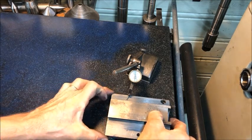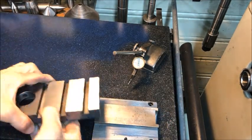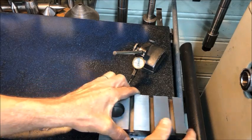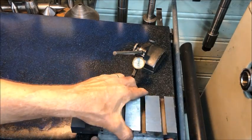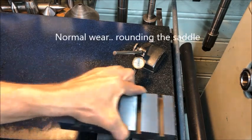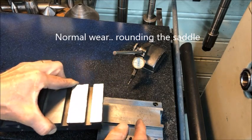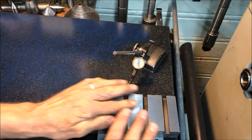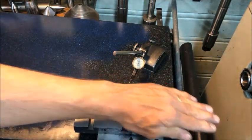And the same repeats itself here. And why is that? It's wear on each side as the cross slide moves back and forth — but it wears down the extremities like this, it goes like this. And when I now apply blue from this to this, I'm just really rubbing along a curved surface.